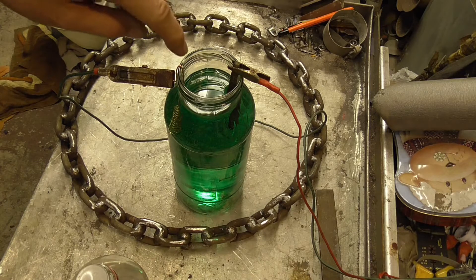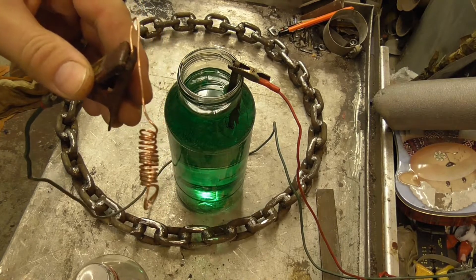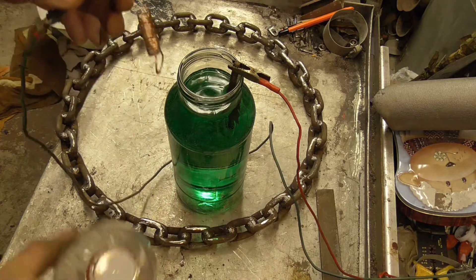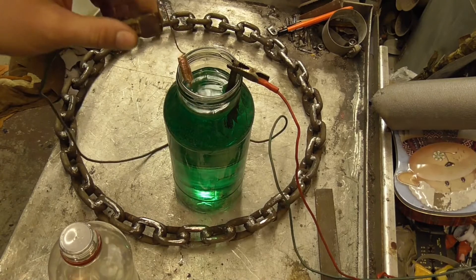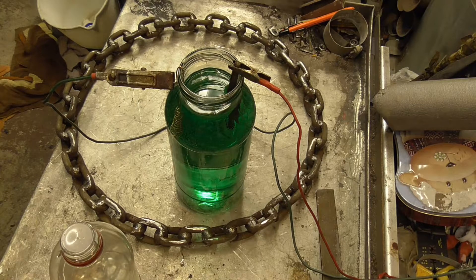We've got a test piece. I've removed the negative nickel from the jar so the cathode has now been swapped for our test piece, which is just a little copper coil. I put that in the ultrasonic cleaner with a bit of detergent to take any greases off, then washed it down with plain old vinegar to get any impurities off. In it goes. I've also swapped back to the 5 volt 1 amp charger, because apparently it works better at lower voltage. Now I'll turn it on and hopefully we'll get some nickel coating.